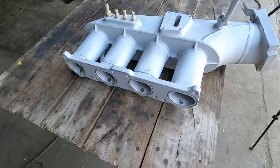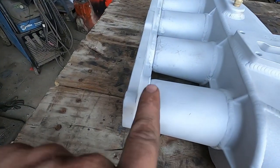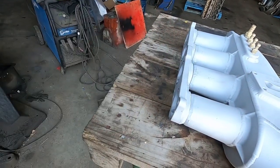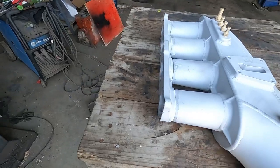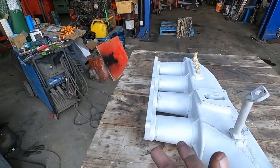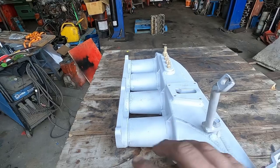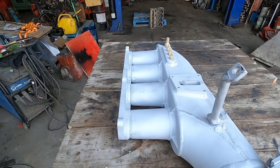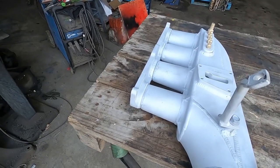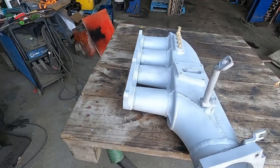Eventually I should find a lens so I can do some arc shots. You can see how I veed this out real nice - I want to be able to get a real good weld in there, so the weld will probably be wider than it really should be, maybe five-sixteenths to three-eighths of an inch wide. This intake is upside down but this piece basically hangs off here with the throttle body and everything. This thing is turboed - the guy that owns it told me - and I'd imagine that's the reason it's cracked. Aluminum only takes so many years of abuse before it cracks.